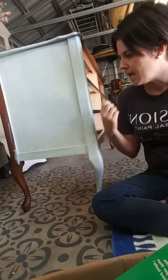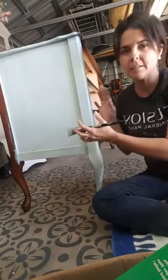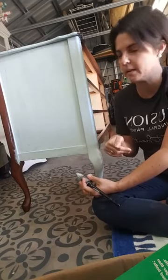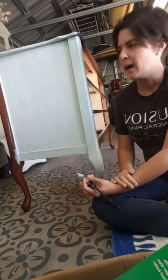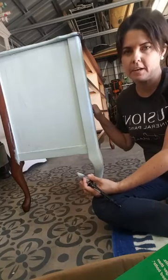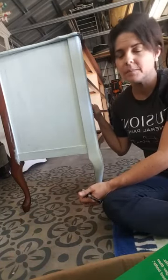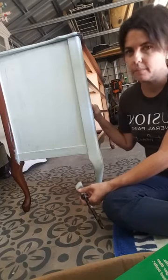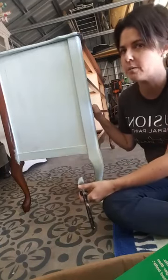Once it's painted and cured, that's it — it's done. You can optionally put a tough coat sealer over it for protection, or a wax. Fusion Mineral Paint has a built-in sealer, so you don't have to put a wax or oil over it — it's one less step and one less product to buy. However, for a piece like this with beautiful Queen Anne legs, I generally like to put a dark wax or dark oil wax over it to give it more of an antique look from its era.